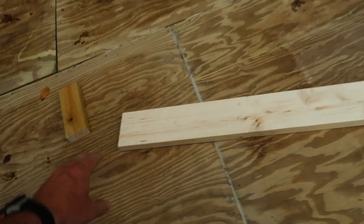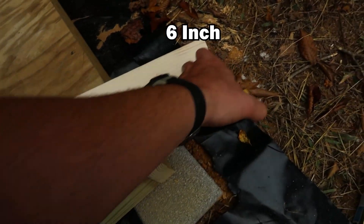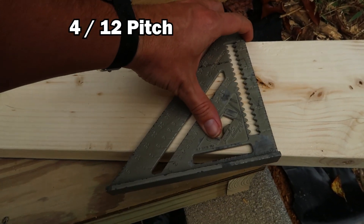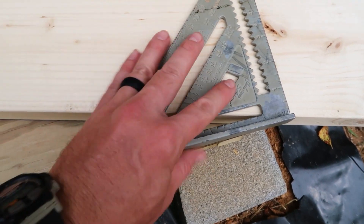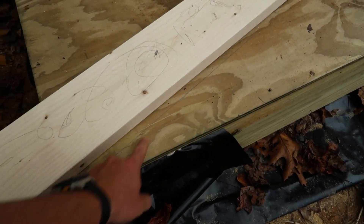The pitch that is here — I wanted there to be a 6-inch overhang on my eaves, and so that's what I've got there. So it's somewhere around a 4. If we were to move this out to match that up on our edge there — here's our 4, but I've got that marked out. And I've already put my pencil mark here where that's going to be.